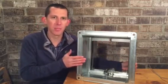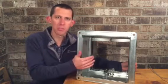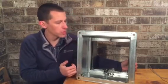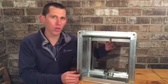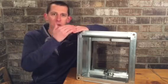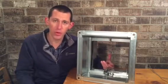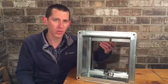In a dynamic system, the blade has a spring that will help it close so that if air is blowing through this in a fire event, it can close against the pressure of the air. So it helps to pull it closed. All right, and a static one, when this fusible link up here melts, which all a fusible link is, two pieces of metal soldered together, and at a predetermined temperature, those will separate and let the curtain fall. So in a static one, this will just fall due to gravity. Okay, the fan has to be off though in that type of system for that to work.